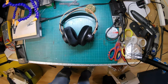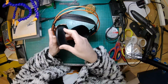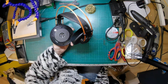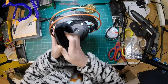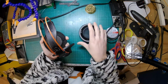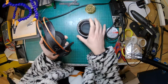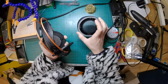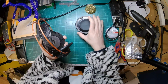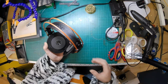Give me a moment, let me pull up a chair and we'll get into this. Okay, let's start. The pads twist off, so we're going to go lefty-loosey, and they come off. So, unlike the Sennheiser and Beyerdynamic pads, these have got a twist lock mechanism, which makes changing the pads easier, but it does make the pad a more complex design, because you've got to have this plastic plate in here, which is going to reduce the number of pads that you can fit on there. You've got to get the right ones, or you've got to kind of fudge something else to fit on there. And it will probably increase the cost of the pads, so if you've got to get replacement pads, they're probably a little bit more expensive.